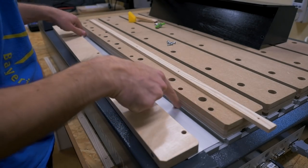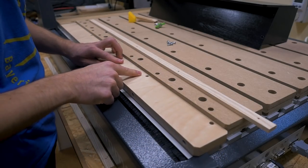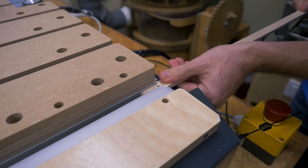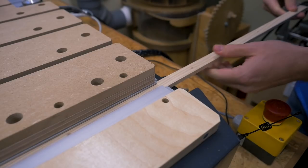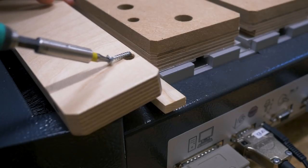Since I still have one slot available right at the edge, I made a strip of wood and pre-drilled holes for screws. The slot fits a strip of hardwood with pre-drilled screw holes that acts as a really long T-nut. I'm just using wood screws with the tip ground off.